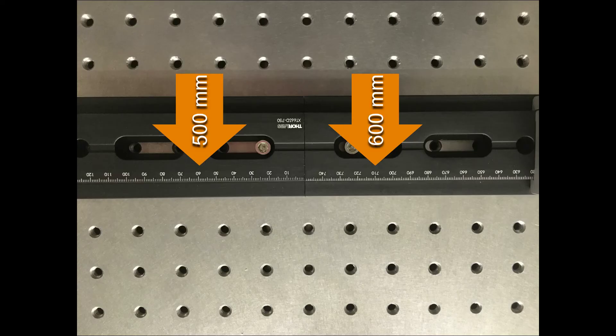After detector two reaches 500 millimeters distance from the beam splitter, two different tracks are connected and the counting starts over on the new track. The new 100 millimeter distance measurements will be at 710, 610, 510 millimeters, and so on along those tracks.